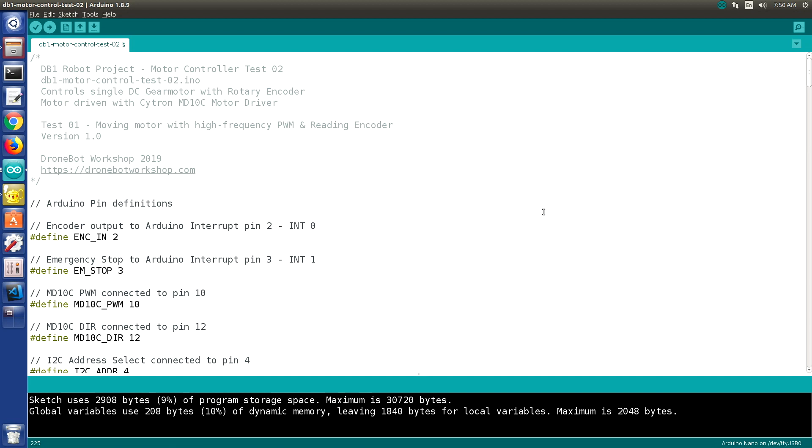Now I just want to show you a few aspects of the code I'm writing — this is a work in progress. The first thing I want to look at is how we select an I2C address. As you recall, on pin D4 on both Arduino Nanos, I have a connection: on one Nano it is connected to ground, and on the other it is connected to the 5-volt line. So one Nano will see this as low and the other as high, and this is how we determine our I2C address. This way we can write the same code for both units, because the only difference between the two is going to be that address.